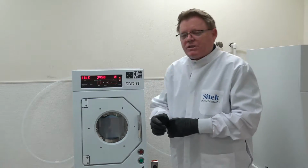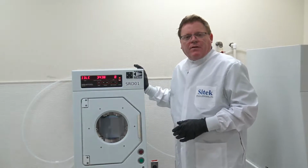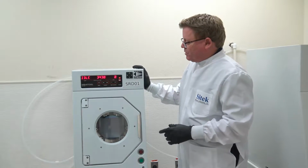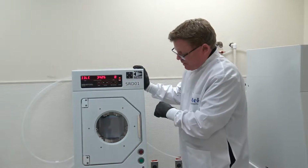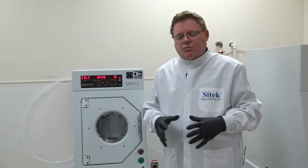This system was not purchased from SciTech. Besides being the U.S. leader in remanufactured Semi-Tool spin rinse dryers, we also are probably the largest company that does repairs and service for customers. This customer had a problem where their wafers were still becoming wet, and they couldn't figure out what the problem was. They purchased this one probably 15 years ago from Retech, who's no longer around. Semi-Tool was sold, so they sent it to us. We figured out all the heating issues, worked on the ACR valves, all the heating elements and so forth. It's running beautiful now.